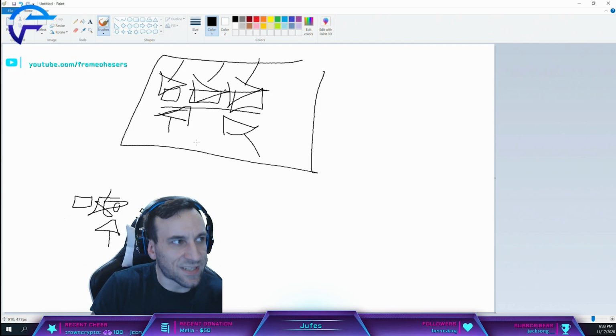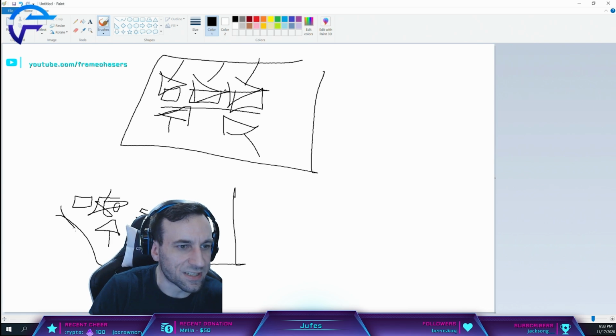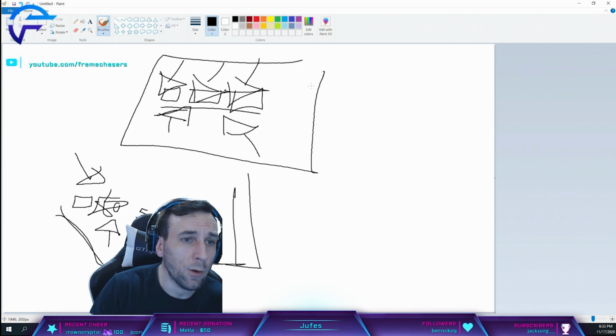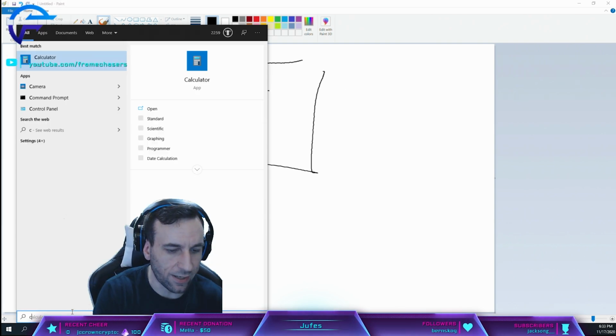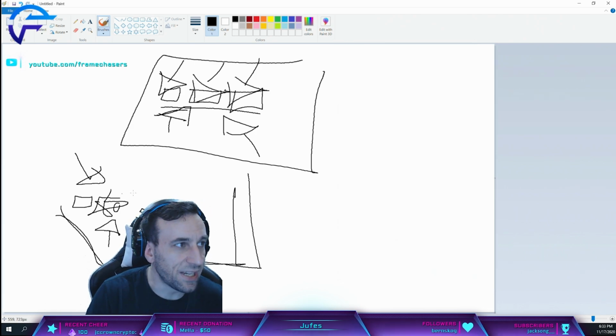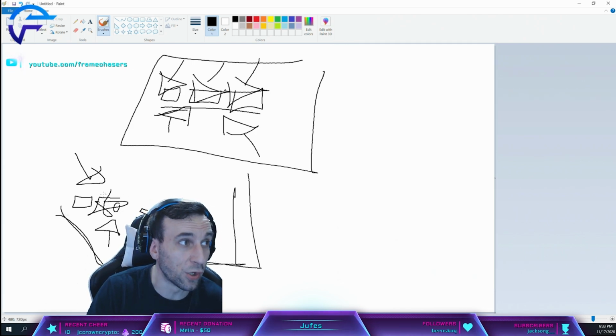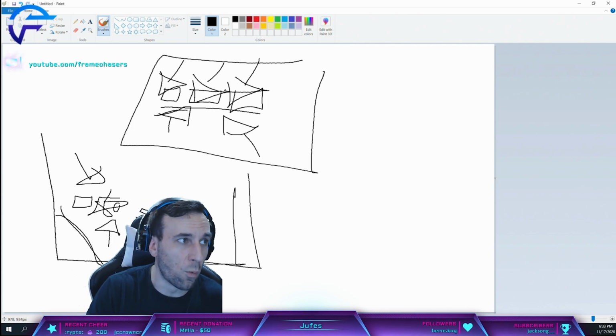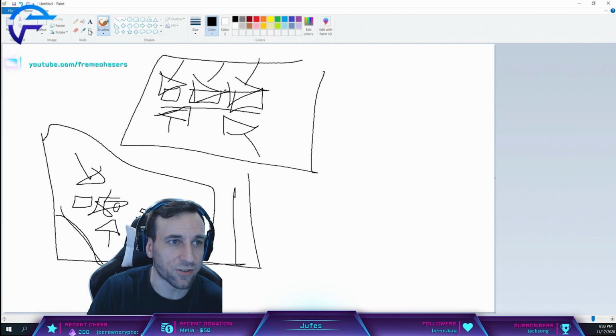So the second problem that happens if you do this is this is going to start pulling up to, like, so if you double shunt these ones and you single shunt this one, what is it here? Hang on, calculator. 80 times 1.625, 130. This PCI Express shunt can pull up to 130 watts, right? So you don't want that going through your PCI Express bus, right?